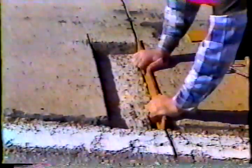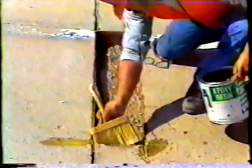Fill the saw cuts with epoxy mix. Concrete won't fill them, and we don't want another spall to have to repair later. Place cardboard in the joints so the concrete can expand and contract unharmed. Coat the spall uniformly with epoxy resin to ensure a good patch.